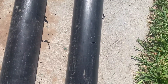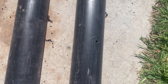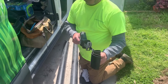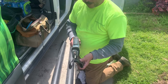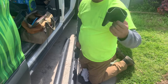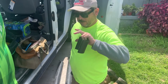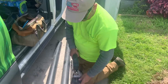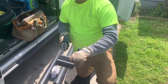Here's a good example of accidentally going through to the other side. We're going to show you how to fix that if it happens to you. The holes are small so I don't need that much space, but the coupler has the same shape as the pipe. I'm going to cut this coupler in half this way, and in half this way as well, giving me four different patches out of one coupler. We use a coupler because it acts like a sleeve or a bandage over that hole, and then we'll use glue to lock it in place.